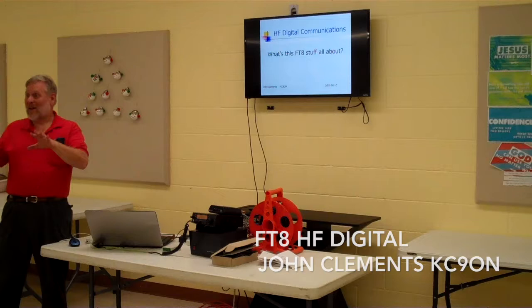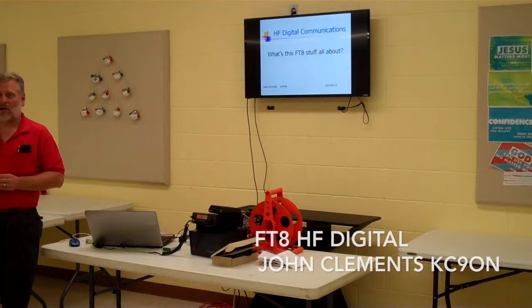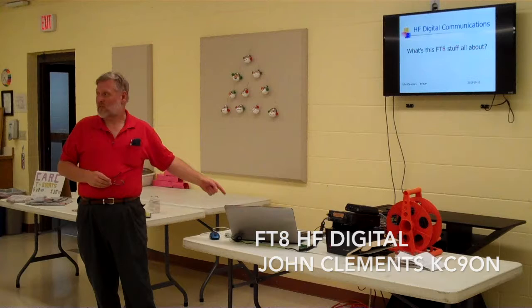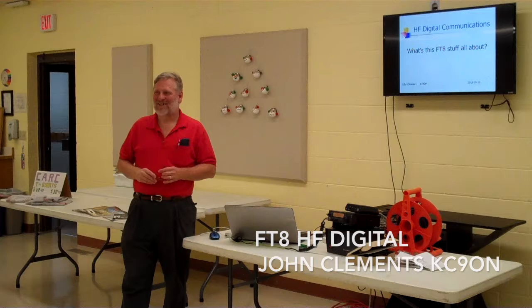So yeah, I was setting up here. I had this all ready to go last night, and I actually had to update a piece of software called FT8 call because it expired. I'll talk about that in a minute. So that was my panic thing last night. Got that up and running, got here, and I couldn't transmit. And it turns out that whenever I plug this TV set in here into my laptop, it takes my regular sound card and turns all the volume settings down to zero and hides them. Yeah, so I finally figured out how to hack through so we can transmit and receive now.